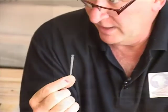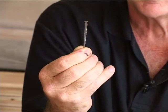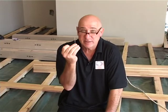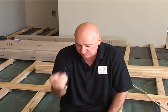Guys, first of all, this is a nail down floor. So they're using a nail that comes from America. You see it's tapered and serrated, and just now you'll see the nailing machine that's actually putting the floor in. It's very quick. A floor like this can be laid in one day, and it's probably about 200 square meters. So it's imperative that you use the right nail to put in a sports floor like this. When it comes to any nail down floor, the correct nail matters, because if you're using a brad nail on a pneumatic, it's the wrong nail, and the floor is going to work itself loose. Right, so the nail is important.